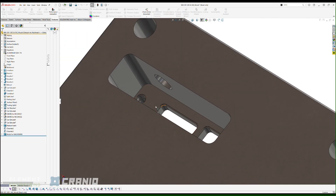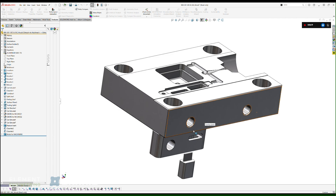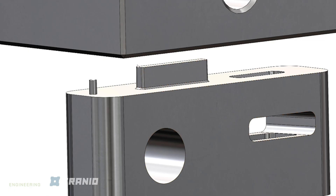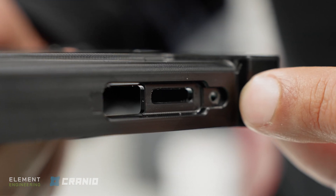The features are on this side. We can come in and machine on the back and actually make that step for one side of the flanges which hold it into the housing. The other side of the flanges have to be made with some sort of pin. So we've come up with a design which is a precision CNC pin inside a pin. This pin makes the tongue that replicates where the circuit board is, and this one replicates the feature of the SD card where the flap will actually hold on to. This pin here is a relief for the pin that holds it in — it allows us to squish the material, get it through into the housing, and it'll then pop out and hold into place.